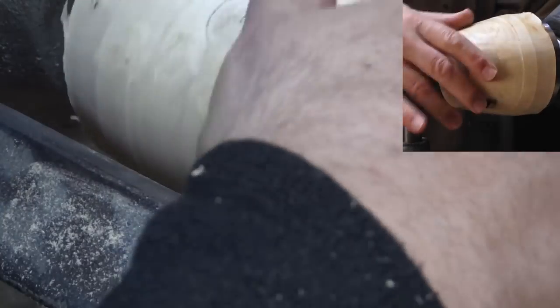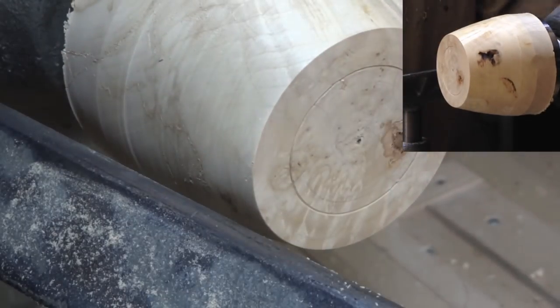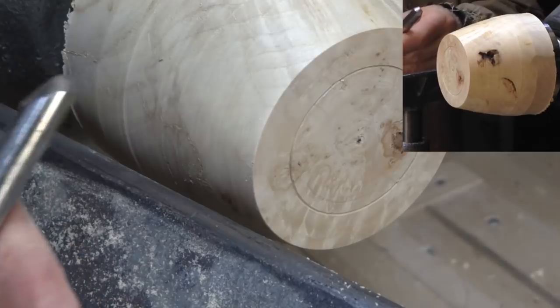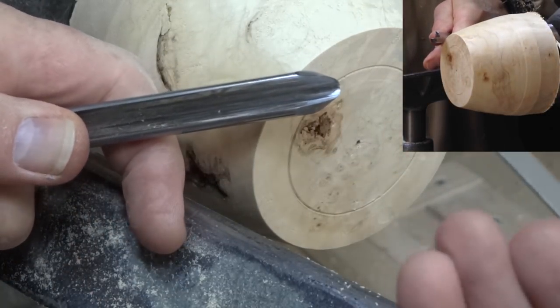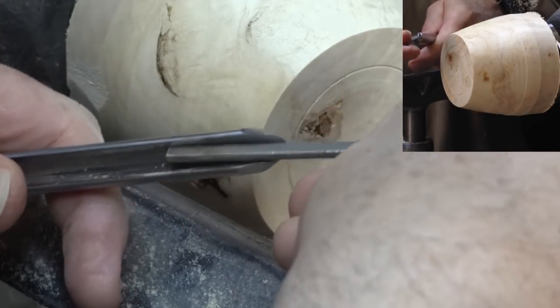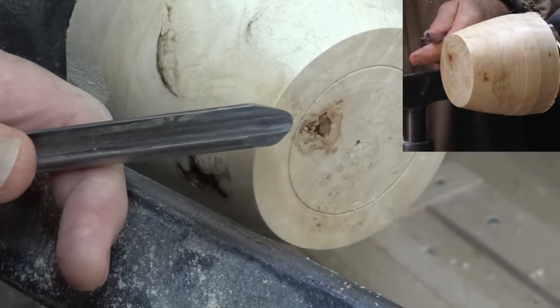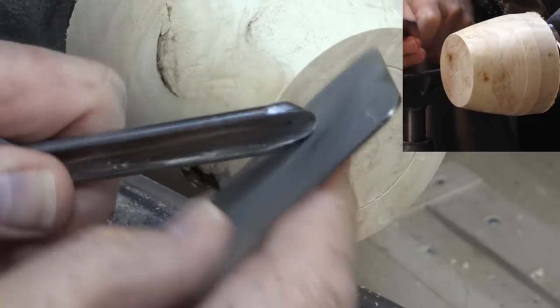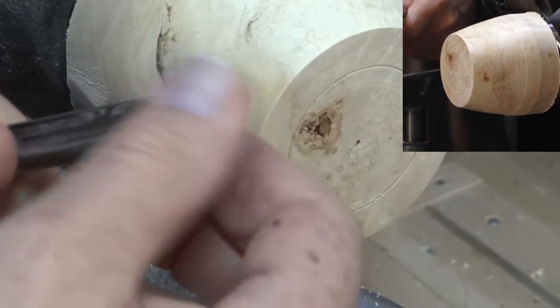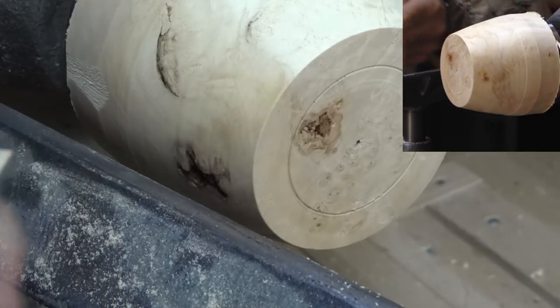That did slide a lot more smoothly, and now, time to sharpen up the gouge as well. After a few passes with a half round diamond file inside the flute, and then a few passes with the diamond card on the outside, this should be much sharper and ready to do some decent cutting.